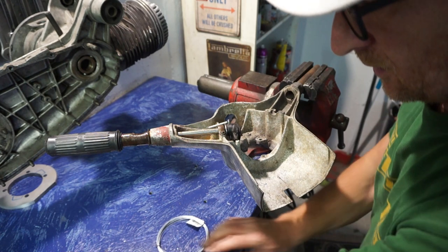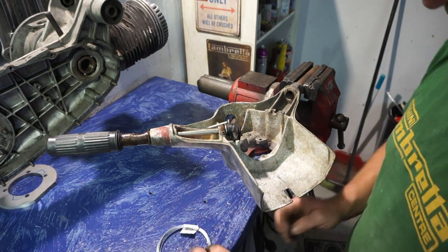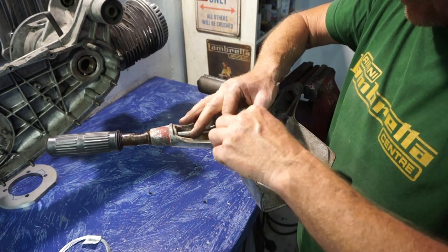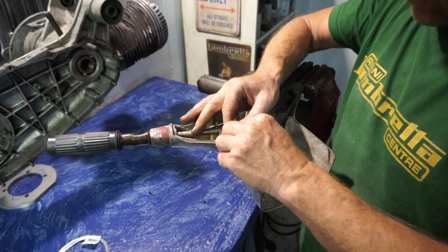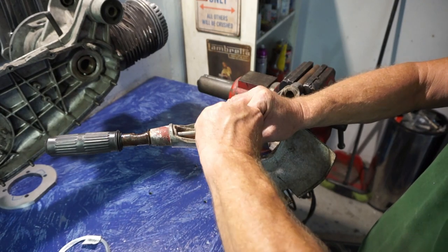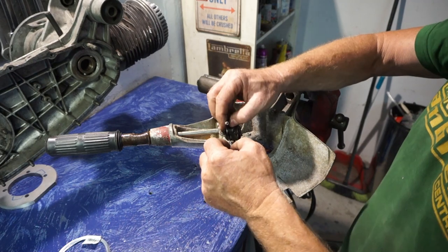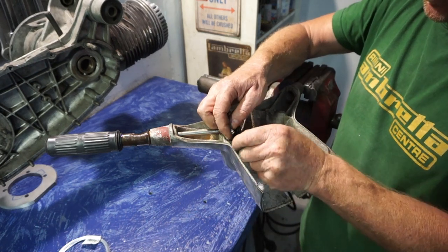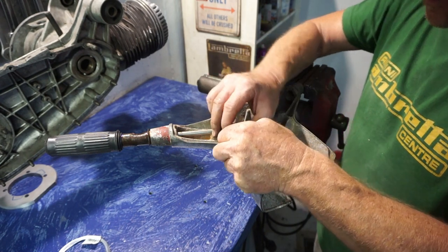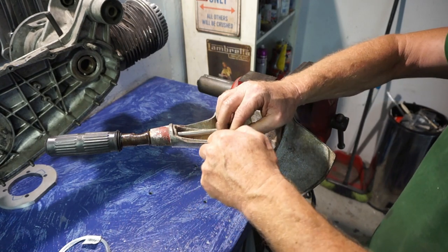Right, that's our small hole. We're just going to take a small snippet of this lock wire and thread it through the hole. This is now going to locate our spring, because our spring is going to get slipped onto this — thusly — and then we can twist our lock wire to hold it into place.